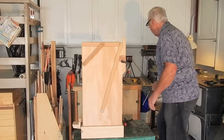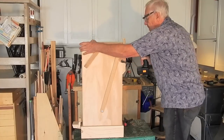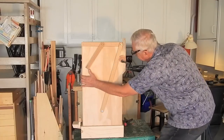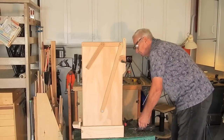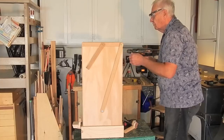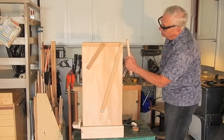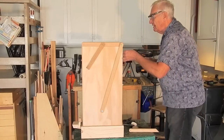While I'm here, I can also drill screw holes from the anchor into the back edge of the cabinet. I'll drill those holes a little deeper because I'm using fairly large screws. I've started off-center and I'm drilling these at an angle so the screws capture several layers of plywood in the sides of the cabinet.